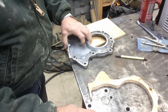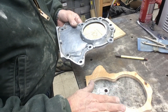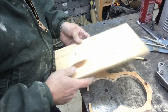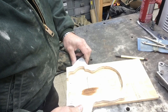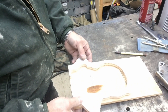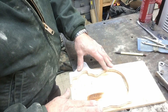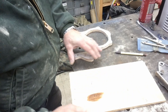The next layer we're gonna compensate for the back piece, or the outer part of our tightening gear here. I think quarter inch is enough for that — this piece is about a quarter inch, maybe a little bit more, almost three-eighths, but that'll be fine. What I did is I traced out the inner dimensions on it so I can carry it on up on the bottom. I haven't added any draft to this pattern yet — I'm going to do that in just a few minutes. This is the inside dimension of where it picks up on the bottom piece that we've already cut out, and I gave about a quarter to three-eighths inch spacing around there.